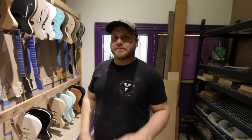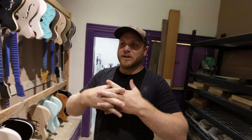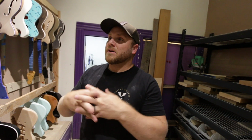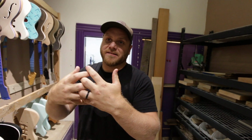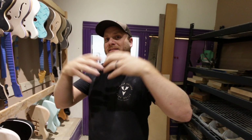It doesn't completely dry or something like that, right? Well, I mean, it does, over time. So that's the reason it cracks. I mean, they say it never fully cures, and that's what allows your guitar to breathe. But lacquers will shrink, but they won't expand. So when your wood shrinks in drastic climate changes, you get the cracks, and then when it expands again, it'll crack the lacquer.